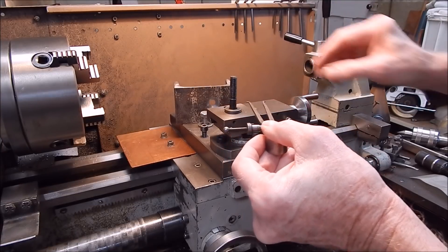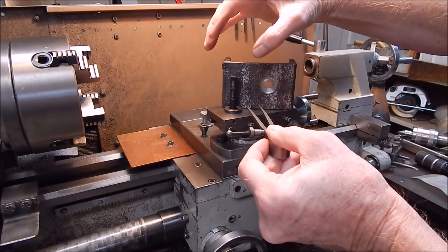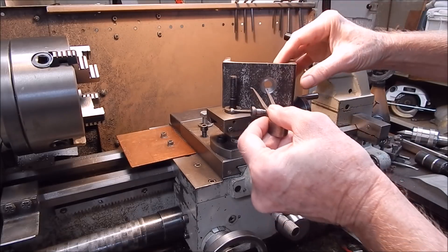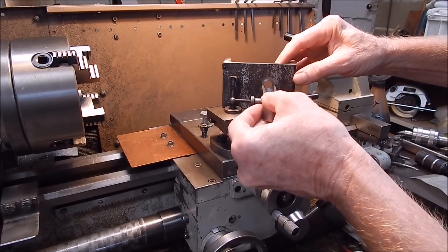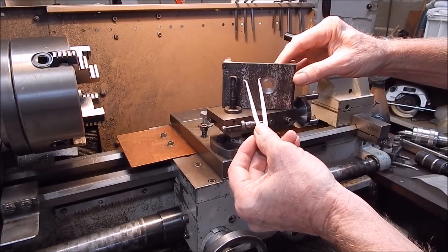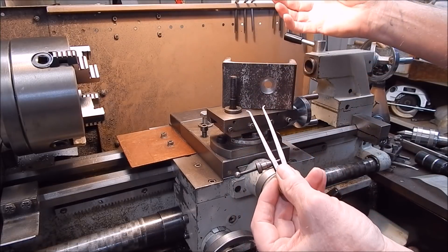Okay, now that fits. So when you're doing your machining in the four-jaw and you can't pull the tool post to bits — because it'll take out your work since it's all centered — you put in your dividers and you can feel the exact same amount of pressure and drag. When you get that feeling, you know you're there, you're right on the money, and that'll be it.